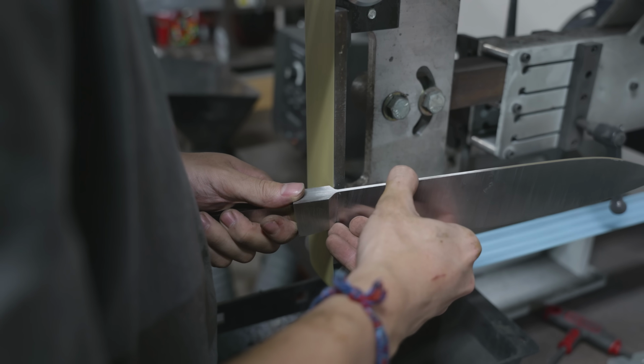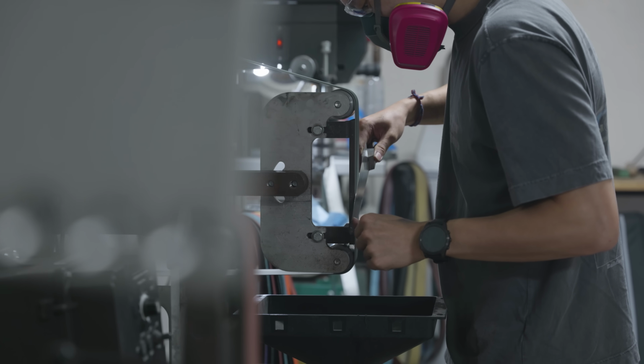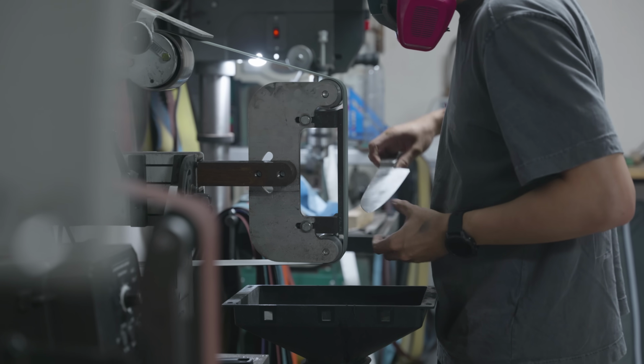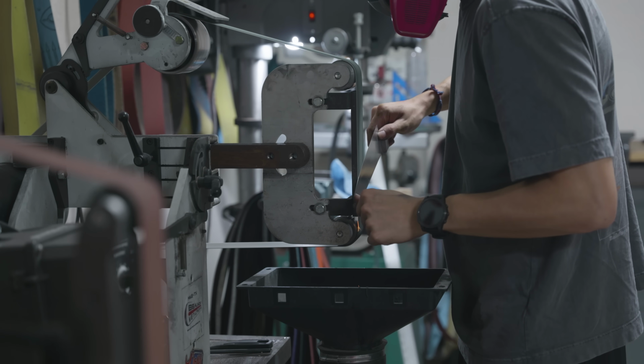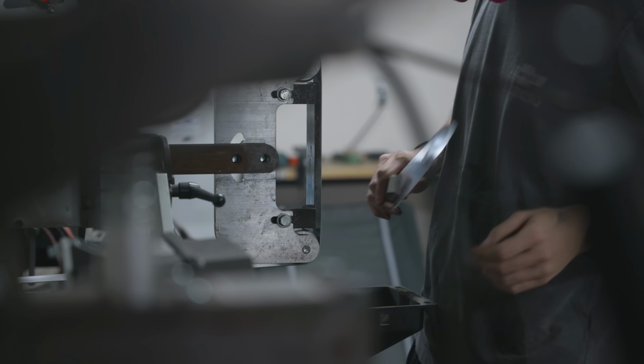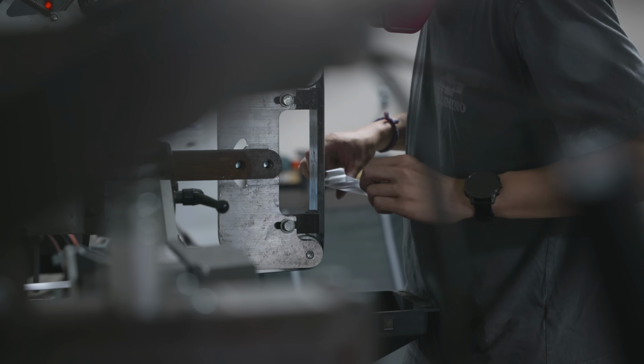But yeah, to prepare for putting on the actual handle and hand sanding later, I bring the belts up to a 400 grit Trizac belt finish. You definitely don't need Trizac belts to get a good finish before hand sanding. The only reason that I'm using these is because I was interested in them and I bought them a while back. They actually last a long time, so that's why I'm still using them today.